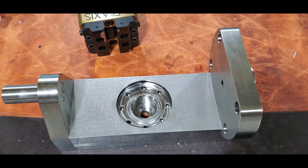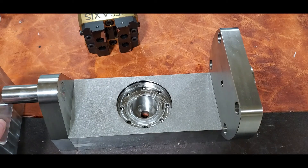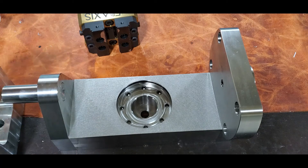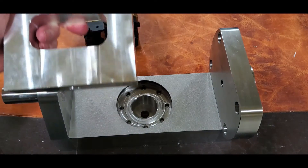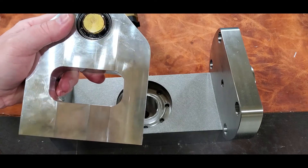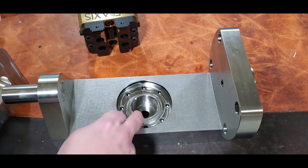There's also something like a tailstock. My machine is the TR 210, and I believe these were designed for the HR 160s. Mine is actually an inch higher than this, so I'm going to have to put a couple of 1-2-3 blocks under it. This is just in the prototype testing phase, and if everything's good he'll probably end up making me one that's the right height — or I'll make one.